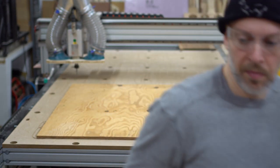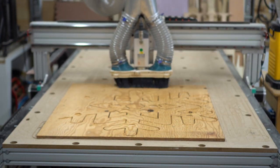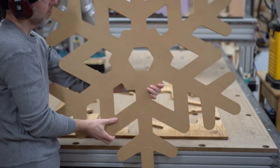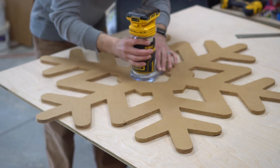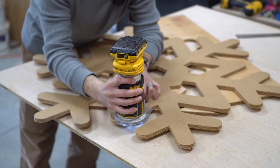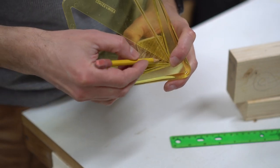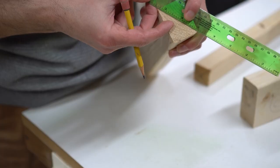I'm screwing down a sheet of half-inch MDO — medium density overlay. This is a great plywood for exterior use; on one side it has a very thin veneer of medium density fiberboard, it takes paint really well, and holds up well to the elements. With the CNC complete, I can turn my attention to rounding over some of the edges and then making the standoffs that will hold the snowflake away from the wall. I just grabbed a couple pieces of scrap 2x4 and I'm using a plastic jig to find the centers of the square, but you can also find the centers by connecting the diagonals using a ruler.